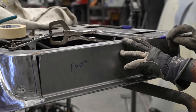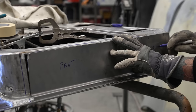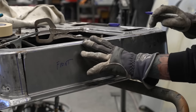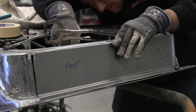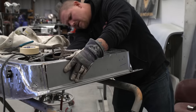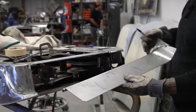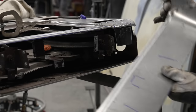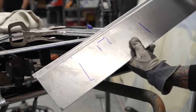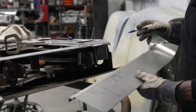where that panel lies, and somewhere in here we need to have X amount of holes. And then on the inside, you can just trace around. Now we have our references of exactly where we can go through and pop our holes. Take a few measurements. If you need to get into some of these other brackets, we can just measure off of to drill our holes.